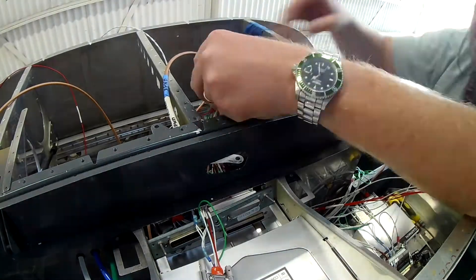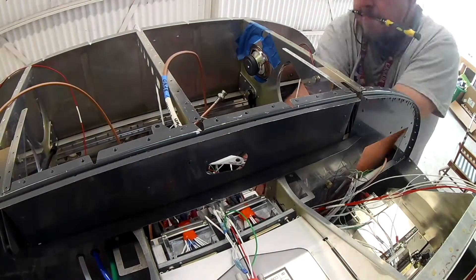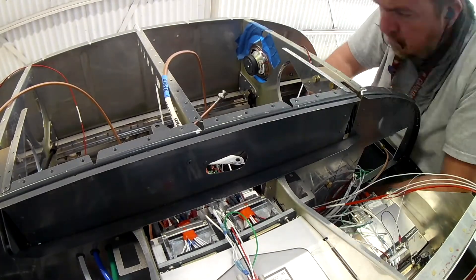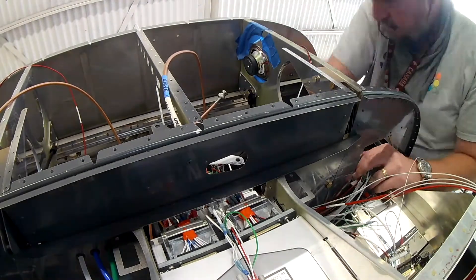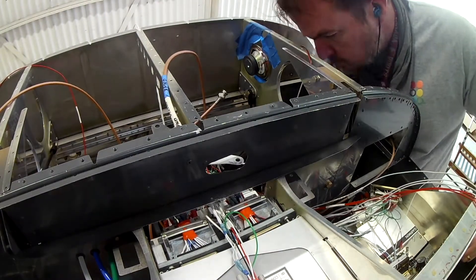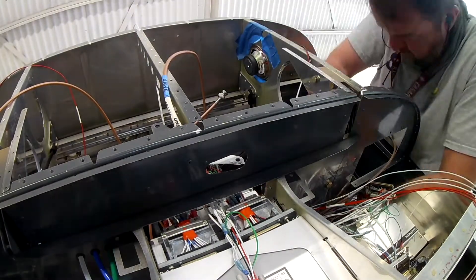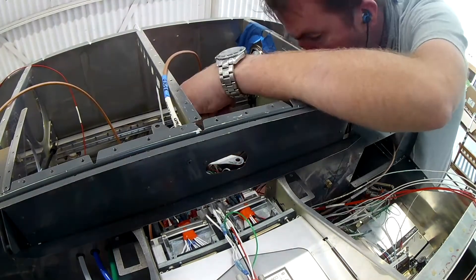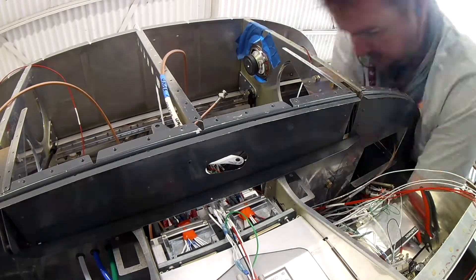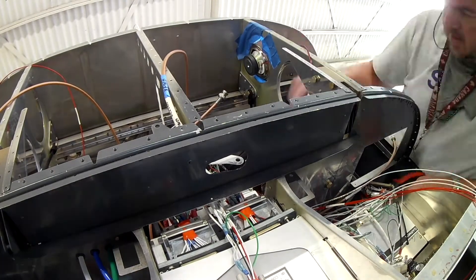What I'm doing is actually going to have a shelf. Right next to where my body is over there is the original hole for the glove box — well, there is no glove box, but it's a hole I can easily get my hand through. There's going to be a shelf behind that and the firewall which will have the remote com unit on it. The wiring for that is actually going to come from behind, towards the right side, underneath the sub-panel, and then go through the front of that hole. I could have brought it around the back, but if I ever needed to work on that wire that would be a big pain. So just having the wire wrapping around towards the front is exactly what I want.